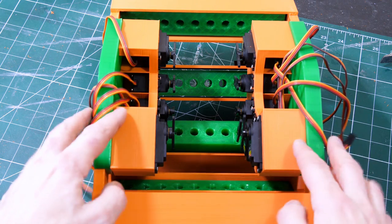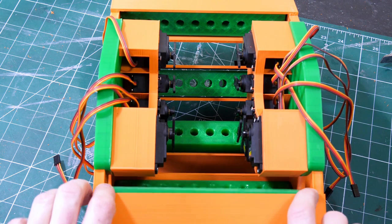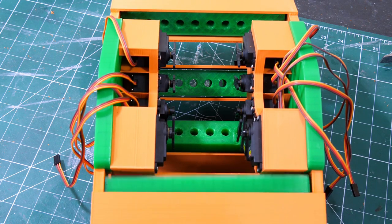I just need to wire all 10 servos and write some code to rotate them. We've only got about 25 millimeters of travel, so a standard-size servo horn is going to be fine, with a lever to a little pivot in two places to the back of each of these.